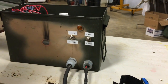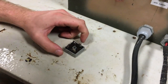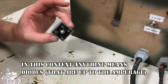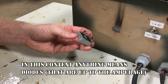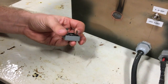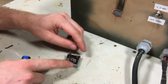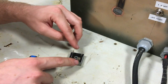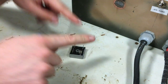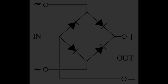This is called a capacitive battery charger. This here is the bridge rectifier — you can build these out of anything or buy them for less than a dollar apiece. I'm not sure where I bought these; I think off eBay and they came out of China — a couple of bucks for ten of them. This one is good to 30 amps. It takes AC mains on two terminals and turns it into a pulsing DC current out of the other two terminals. Inside there's just a series of diodes — you can look up the schematic; they're pretty simple.